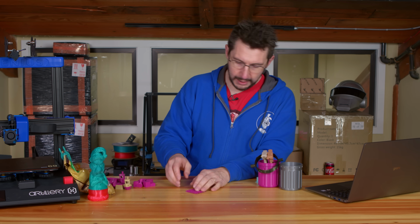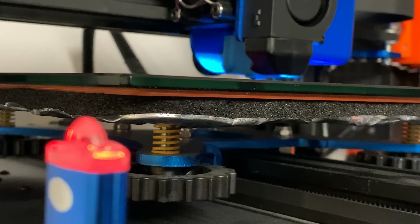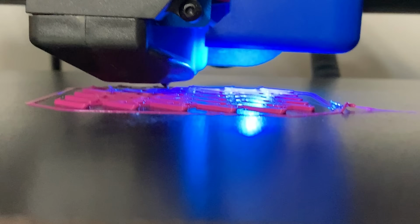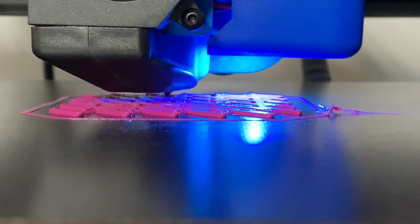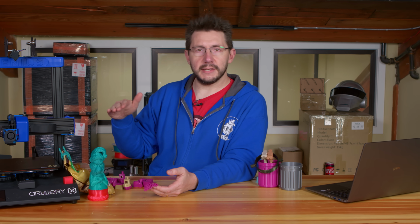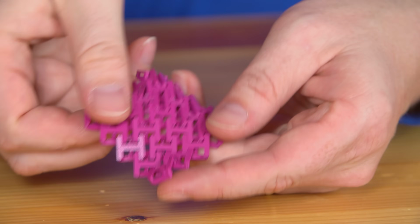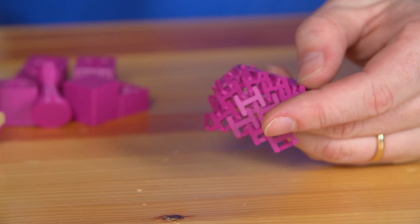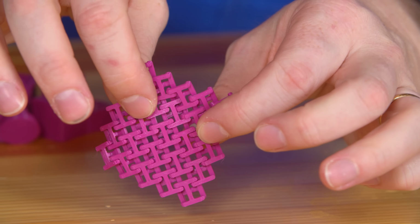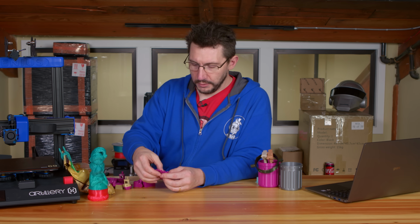This is the Flowistic fabric, or I think it's called the fabric, right? It's basically chainmail, yeah. This is a small section of it, and I was able to print it on this machine, and it turned out great. And I didn't have to break anything away. This is a function of your layer height set correctly and your extrusion parameters, for the most part, set correctly, because all of these small little contact points all have to exist on the build plate at once. And if they touch each other, then you have to kind of break them away once you pull this model from the bed. If they're not touching each other, you have to make sure that they adhere to the bed well enough, else something is going to lift off.